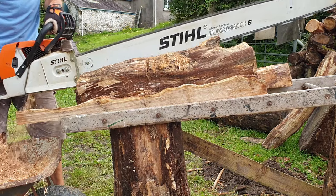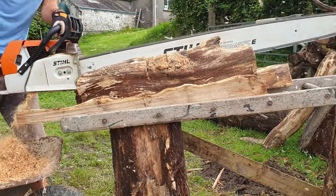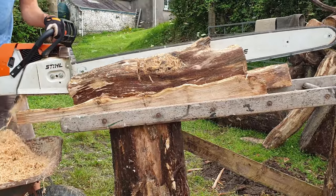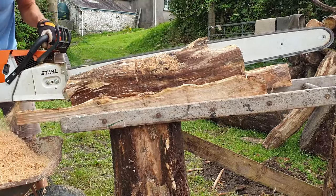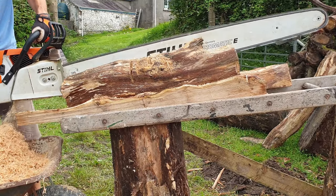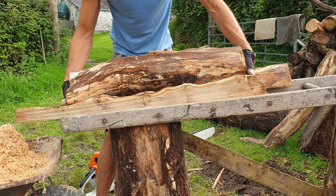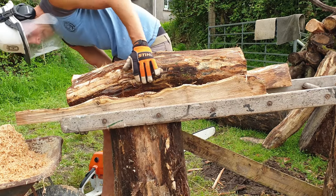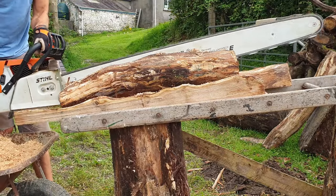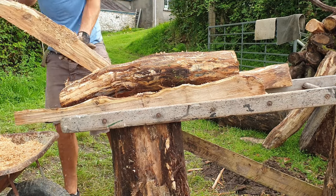These were just branches of oak that were destined for firewood. It's enjoyable to cut with the grain in this way — the chain just creates these really long ribbons, and as long as the saw doesn't bog down it cuts really well. In comparison to typical chainsaw milling when you're cutting across the grain, it's a bit faster and much less dusty.